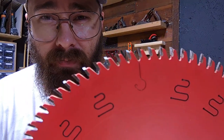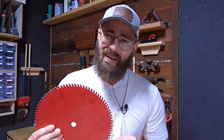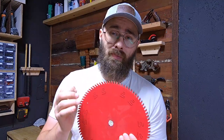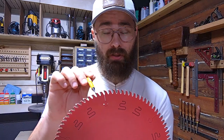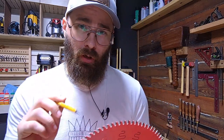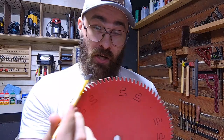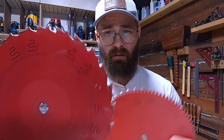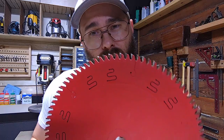It also helps to reduce noise. On the blade, you'll notice that every blade has carbide metal teeth. The more expensive blades have larger and thicker teeth, which can be sharpened multiple times. The less expensive blades have smaller carbide teeth, which don't sharpen too well — you kind of get what you pay for. The space between the teeth is called the gullet, and this helps to remove chips and waste material throughout the cut. Ripping blades have fewer teeth and deeper gullets, while cross-cutting blades have more teeth and shallower gullets.